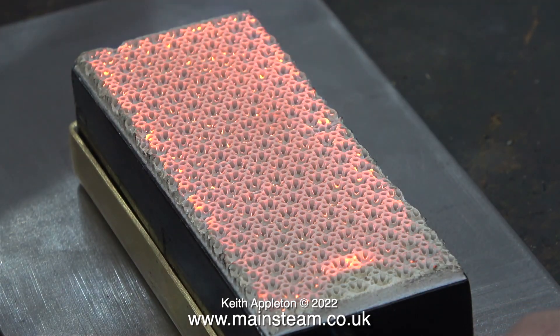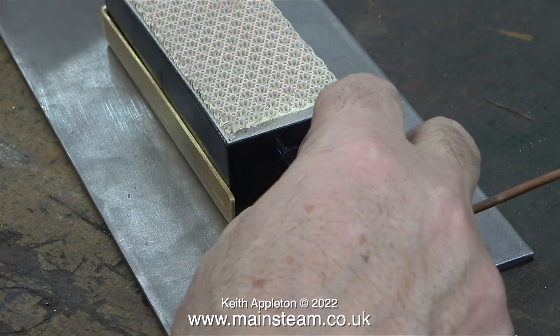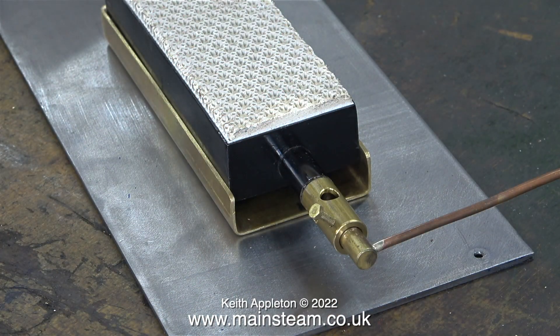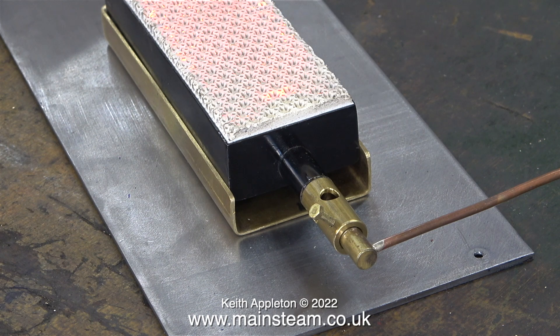You may be wondering why yellow flames are appearing — this is nothing to do with the burner, this is me. I'm blocking up the air holes just to see what happens. When I blocked up too many of the holes in the Venturi tube, the fire went out, so here I'm relighting it. I'm only really making sure that the burner works and seeing whether a number 12 jet works with it, because the ones that you get with these are number 10s, and I find them just a little bit feeble.